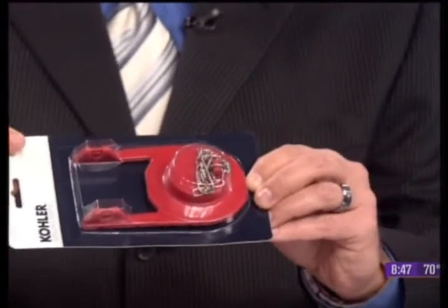And you don't need a plumber to replace a flapper. I think a lot of people are intimidated when it comes to fixing toilets. No, just open that thing up and let them go to work. The couple pieces of information you need is the name of your toilet and the year that it was manufactured. Why not use universal? In the world of toilets, universal doesn't work. Universal is there to just kind of make a fit. Get the right part for your toilet, the one that's made specifically for it.